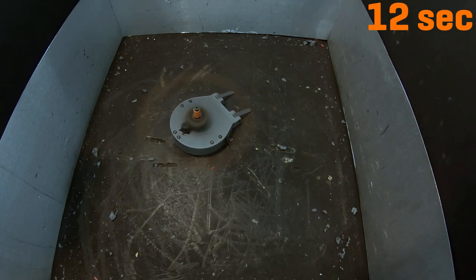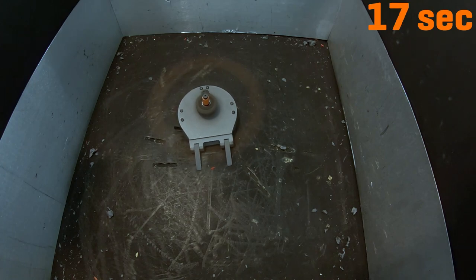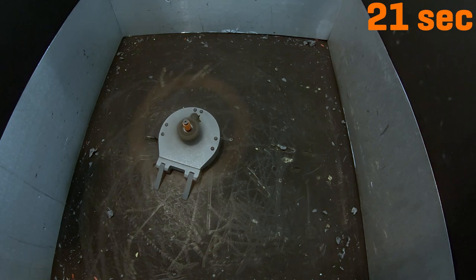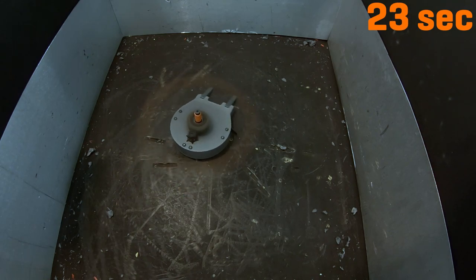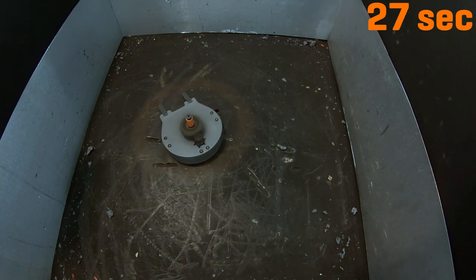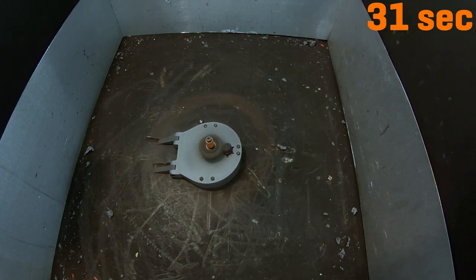For one, it cannot remain stable if I spin up too fast. From some Facebook discussions, this may be due to the weapon being very long and thin, with not as much weight distributed over one axis as it has over the other axis. I might be able to use alternative weapon designs to reduce this issue. Second, occasionally a hit will make the bot glance off at an upward angle, and it can flip over. Not much I can do about that besides self-righting.